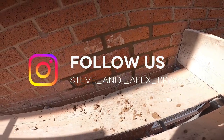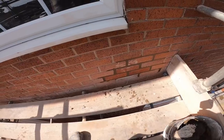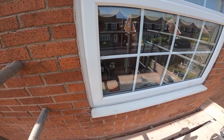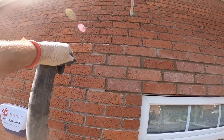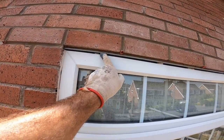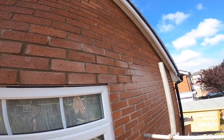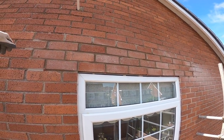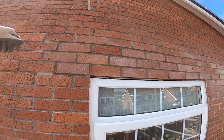That's it. Just patch those three bricks in now, where the flue was badly patched. That's sorted. Just need to have a tidy up now. Gonna be tough. Alex usually does the tidying. Yeah, that's us. Well done. New lintel, new tray, new vents, standard. Wasn't too bad, but a lot easier than when I'm going tomorrow, because the mortar on the job tomorrow is just unbelievable. This stuff came off really easy.